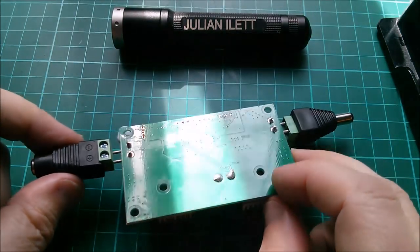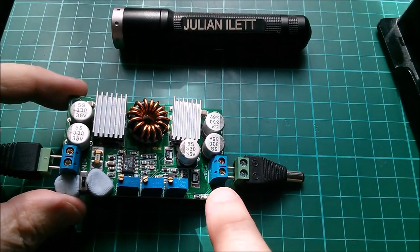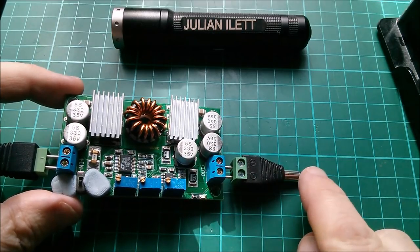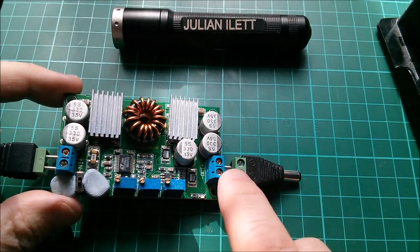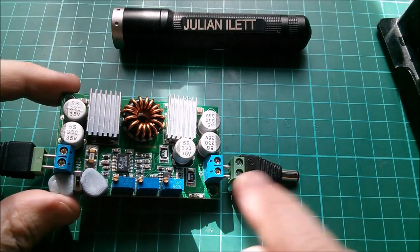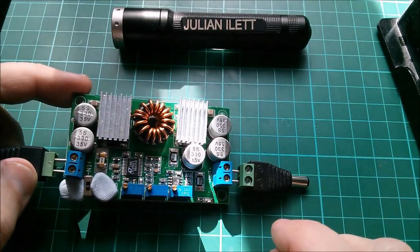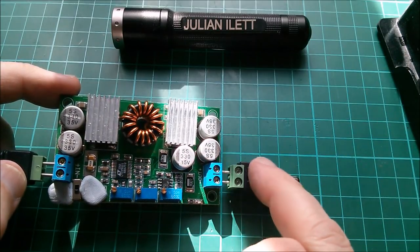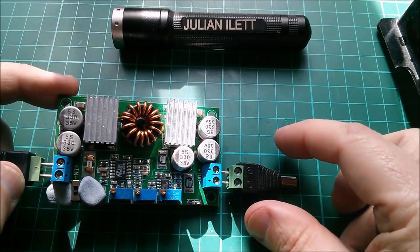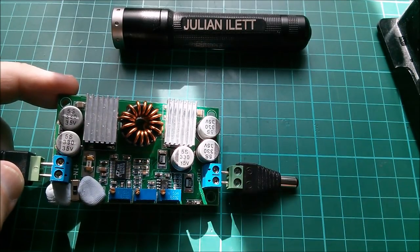What I want to do is charge a supercapacitor bank with six supercapacitors to about 16.2 volts. But the listing for these power supplies says no anti-back-feed protection - if you're charging a battery on the output of this, put a diode in series so it doesn't back-feed into the unit. What I want to do is start charging a capacitor bank to a low voltage - three volts, five volts, eight volts - then switch this thing off and see whether I get any significant back feed, and more importantly, whether this device actually blows up. I'll keep taking the capacitor bank to higher and higher voltages with no series protection diode, just to see whether this thing is happy with a capacitor pack having 16.2 volts feeding back when it's off.